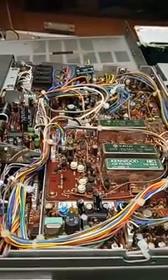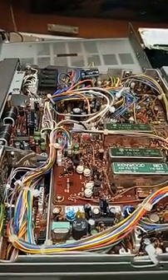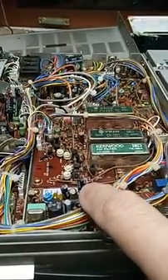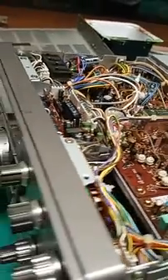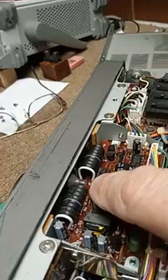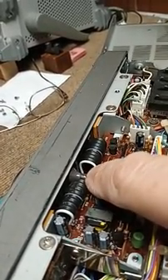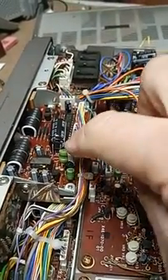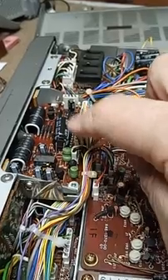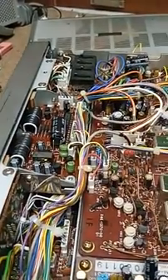This thing was a holy terror to restore because I had to put in 125 electrolytics — literally, I counted them. The front panel vacuum fluorescent display requires extreme care not to break the vacuum tip, because that is a vacuum tube. This board had never been cleaned underneath and had grown contaminants across it, causing leakage and display segments to stick on.